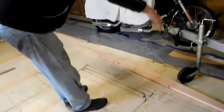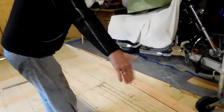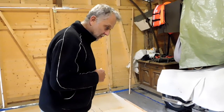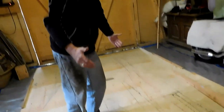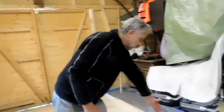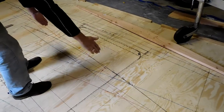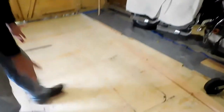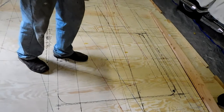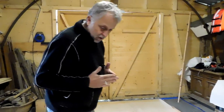It's a full-width coach roof - raised deck as it's called - so the return of it comes down like that. You get all that from the plan, from the table of offsets, from the lofting lines. Here's the curve for the fore-deck, so there will have to be a fore-deck beam so the fore-deck can rest on the front side of this bulkhead. The aft side supports the raised deck. I've marked out the hatchway with radiuses on the corners, because sharp corners are always points of concentrated stress, so we're going to curve the corners - this is a major structural member.